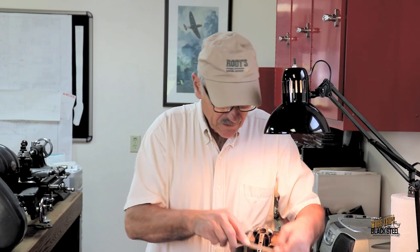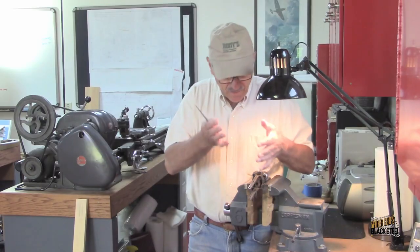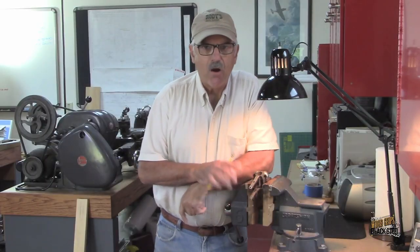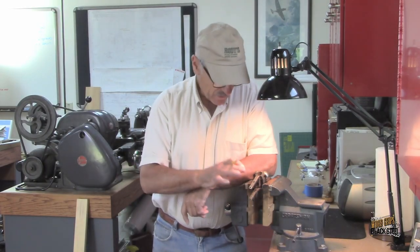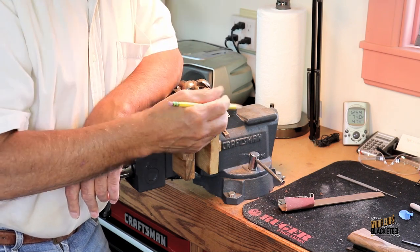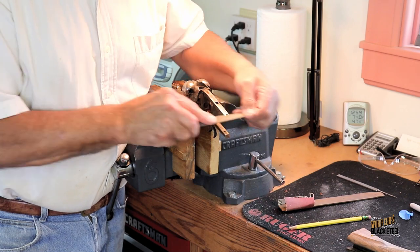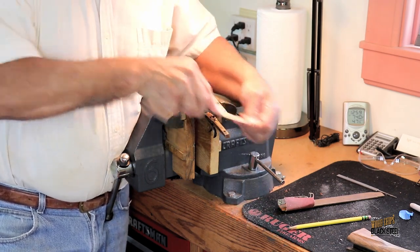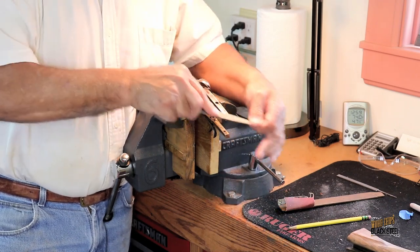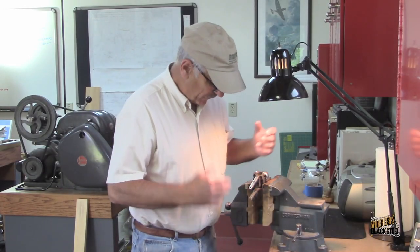Right now I just want to get this metal where it's slightly high taken down so that it's the same level as the wood on the gunstock. I've already fit this into the stock and I know where I'm slightly proud — it's only about a half an inch from this point to the end. We're only off a couple of thousandths. I'm using a fine file and just bringing those edges down a little bit, trying to match the original contour without changing it — maintaining the original design cues from the original manufacturer.